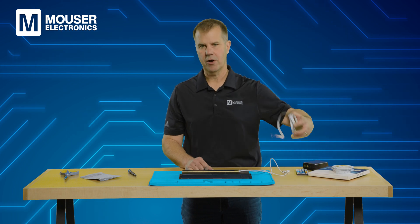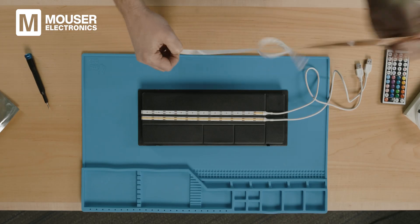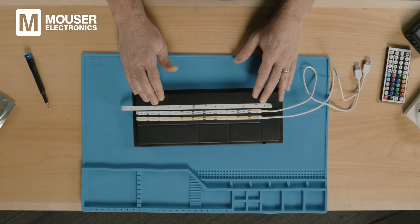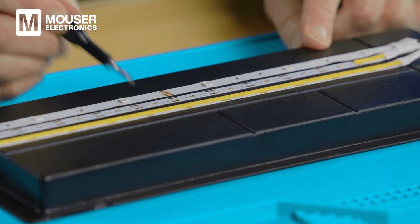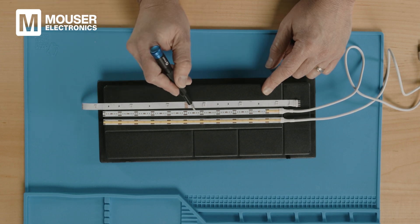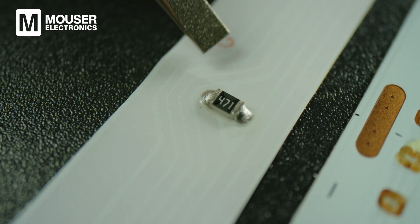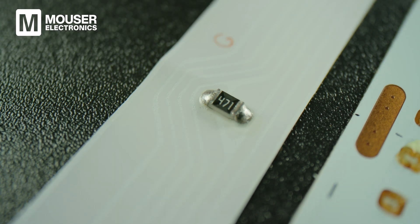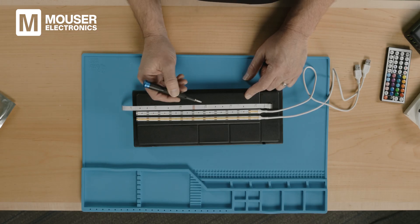Now let's check out the design and manufacturing of the RGB light strip, mounted here in parallel with the white LED strips. Without even the lights on, the obvious difference is that there's no LED diffuser on the RGB light strip, and these LEDs are much much larger. Each LED has its own dedicated current limiting resistor, whereas on the white strip eight LEDs share one resistor. The resistor value can be calculated from the three-digit code on top — for example, 471 indicates 47 times 10 to the first power, which is 470 ohms. These RGB LEDs have a 5050 metric footprint, meaning 5 millimeters by 5 millimeters.